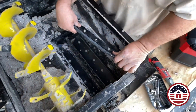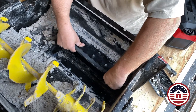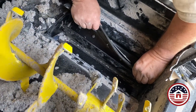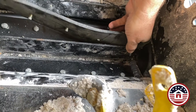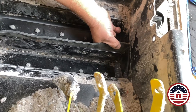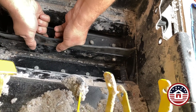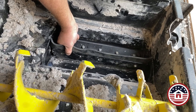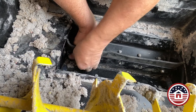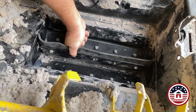To put this back into the airlock, because it is a new seal, new seals are rigid and they're going to fight against you a little bit. I always like to tilt it and work from one end to the other and get the first bolt into place. You can see how I'm putting a little bit of pressure on that seal to bend it and getting that first bolt into the plate. I'm going to hand-tighten this first bolt down so we don't lose the placement, then work the rest of the bolts into the plate through the seal. On the other end, I'm going to put another nut on that bolt to hold it. From here on out, it's simply putting the nuts on the rest of the bolts and tightening them down.